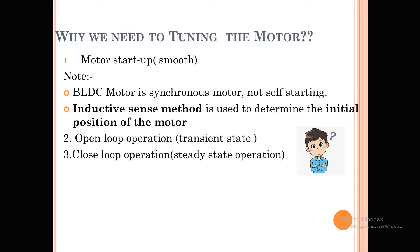For that, first what we need to do is sense the rotor position, and how are we going to do this? By the inductive sensing method. Inductive sensing methods are utilized to sense the rotor position inside the motor. When we sense the rotor position, we know where exactly the rotor is situated, and based on that we select a suitable current value.